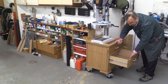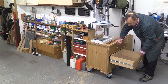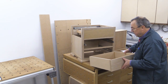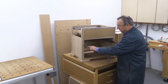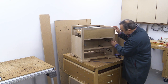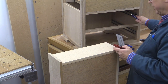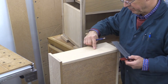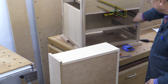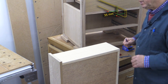These drawers down here are identical to ones I've made in other cabinets — 18mm MDF, veneered MDF at the front, and some dominoes to keep that together. I've got the last two drawers made now and I'm going to fit them. I'm going to measure to the centre line of the runners from the base, and also estimate how far back the hole should be from the front of the drawer. For this far side, I've scribed a line from the base — 80mm from there — and that's my centre line. It's 35mm from the front of the part that gets fixed to the drawer to that adjuster.